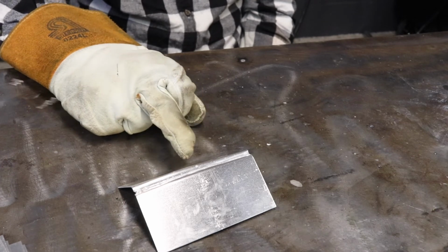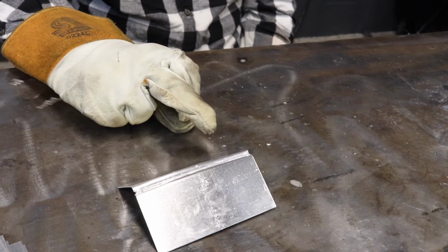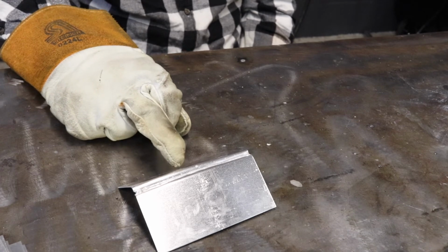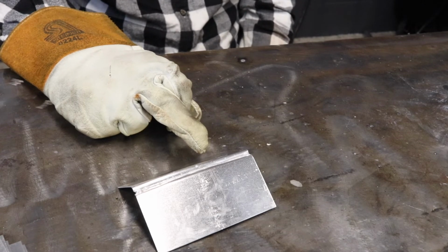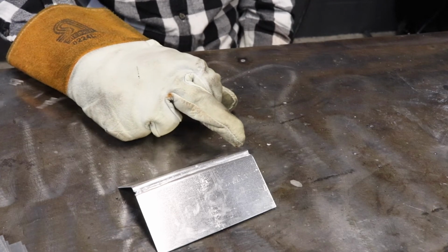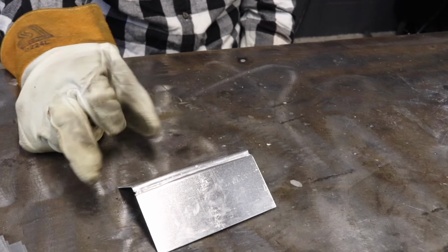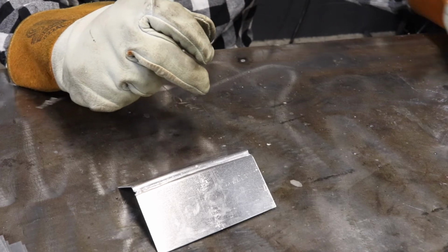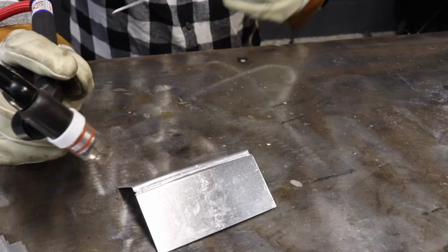The next one we're going to do is we're going to weld with pulse with filler rod, but this was 33 pulses per second, and I probably can't get the rod in fast enough on 33 pulses per second. And if I were to weld like this, pulse with filler rod, literally I would just do lay wire, which I can actually show you on this backside of it. With 33 pulses per second, I'm going to use filler, but we're going to do lay wire.